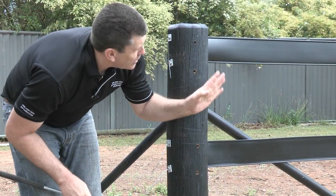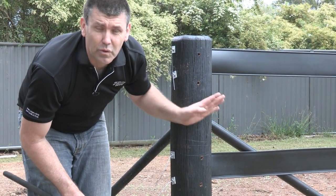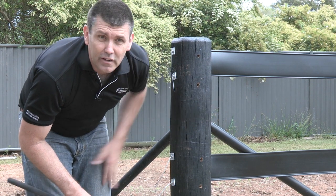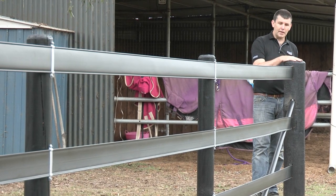Now we're going to go to the other end of the fence and put a little bit more strain on the other end of the fence where we originally did what we called the dead end post. And that's how you strain bounce back horse fencing. Thanks for watching. Okay, we've strained what we call the dead end.